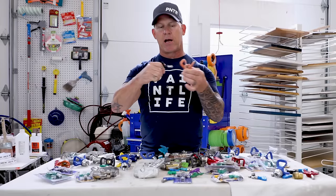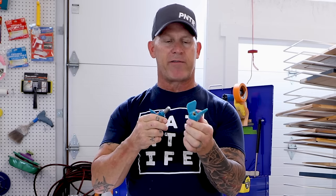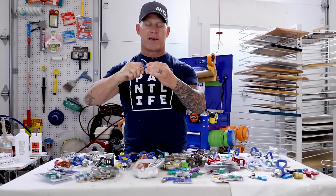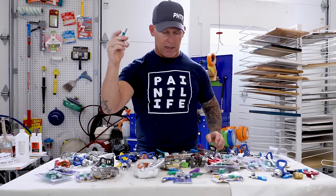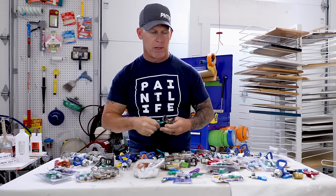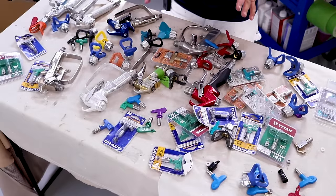The Rack Five tip goes into the guard but will come right out when in spray position — no lock. Interestingly, this China-brand guard actually does lock in position, so my assumption about cheap guards was wrong. FarbMax tips go straight in with no locking, and Tri-Tech tips — which are nice tips — also don't lock in the spray position, despite being designed in a way that suggests they should.